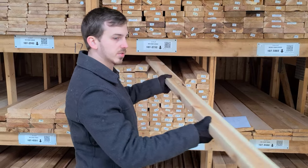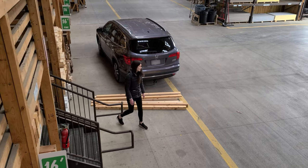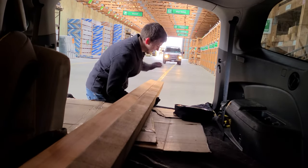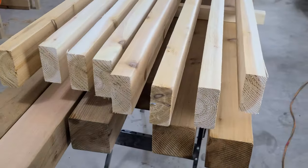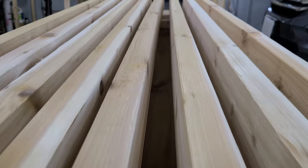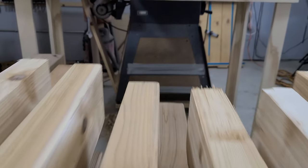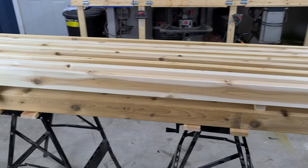Just make sure to spend the extra time to evaluate each board. Take the time to look for defects, warps, or twists. Sometimes you can cut these bits off, but you'll want to confirm that before you bring them home. Once you have the boards in the shop, it's important to let the boards acclimate first. We bought these boards from Menards, who keeps them in an open-air warehouse. It was also raining the day we collected the wood, and the boards felt quite cool to the touch and some were almost damp, so we spaced them out and gave them a few extra days to dry before beginning our project.